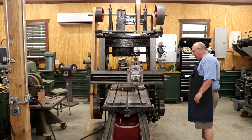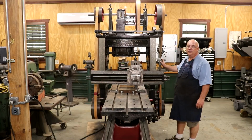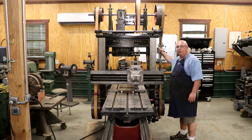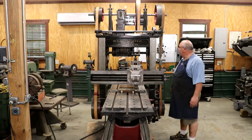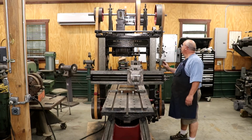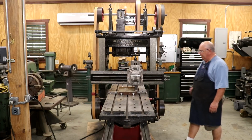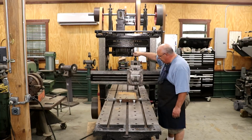And now that belt comes off, so we're gonna do the same thing over here. Well, guys, part of the joy of working with flat belt machinery is just this, having to deal with these belts. Especially when you have new belts like these, they haven't been ran very much. They tend to stretch a lot at first. They get looser. So I'm not surprised we're having to do this, but hopefully this will resolve our problems. And get back at it here. Let's see what happens.